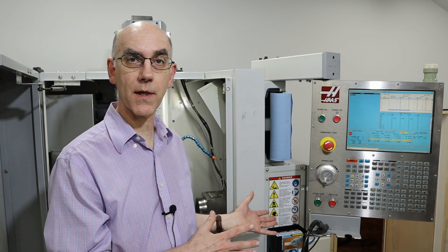In the last episode, one thing I wasn't sure how to handle was aligning the machine to eliminate twist. I spent quite a bit of time talking to the regional service manager for the local HFO and learned that this machine is actually designed so that it can be on casters and wheeled from one location to another. Because of that, it doesn't really need to be aligned for twist — you basically just get it fairly close to level and then you're off. The leveling I did last time is all that I need to do before I can start.